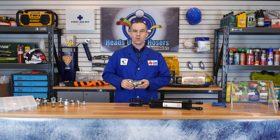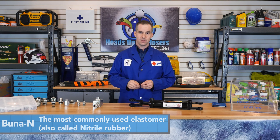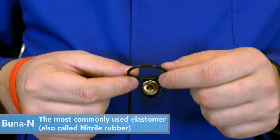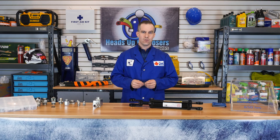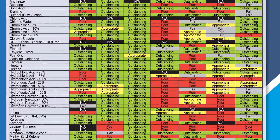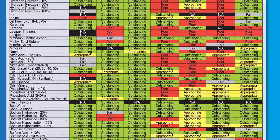To avoid leaking, an O-Ring must be chosen that is compatible with the fluid in the system. If you miss this step, your O-Ring could deteriorate and the system could fail. The most common O-Ring is Buna N — this elastomer is a great general purpose sealing option, resistant to many oils and lubricants and has a wide temperature range. For specific applications, please consult the back of your Greggs catalog for an extensive list of fluid and elastomer compatibility.